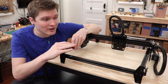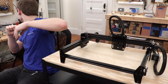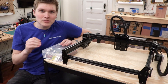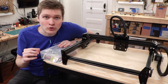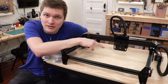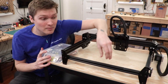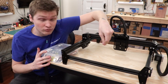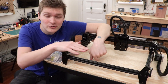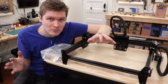It's not connected to a controller board yet, so that's why I have this guy. A pick and place is a really tricky thing to control because it has a lot of stepper motors — X, Y, and Z for moving the head around, plus one for the head to rotate in place, because when you pick up a component you might need to rotate it to match the footprint on the board. That's four motors, and sometimes there are conveyor belts too. It's really hard to find something that's going to control all of these different motors.